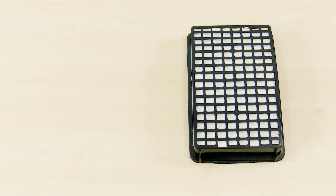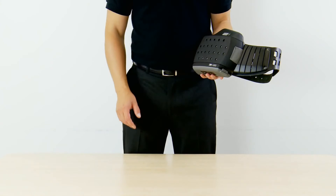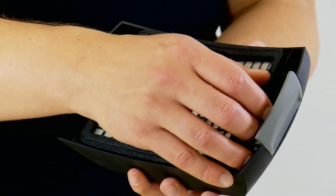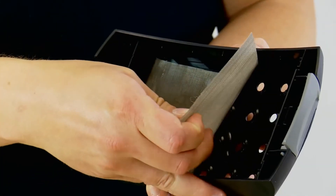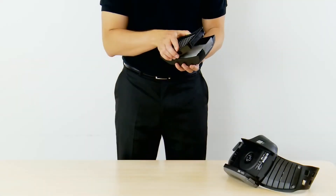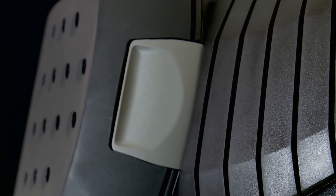Your AdFlo Turbo comes with a particle filter, a pre-filter to prolong the life of the main filter, and a spark arrestor fitted. Remove the filter cover from your AdFlo by pressing the latch and lifting the cover off. The first item is the particle filter, followed by the sacrificial pre-filter, which will need to be checked and removed more often than the main filter, and then the spark arrestor. When putting the filters and spark arrestor back together, load them up into the outer cover and then connect to the turbo unit. Snap the outer cover back into place — an audible click confirms it is located properly.